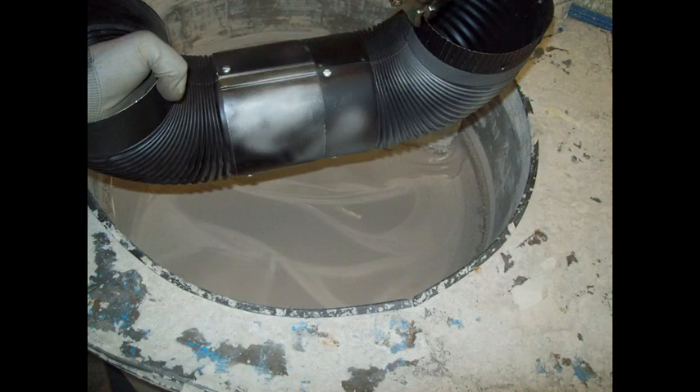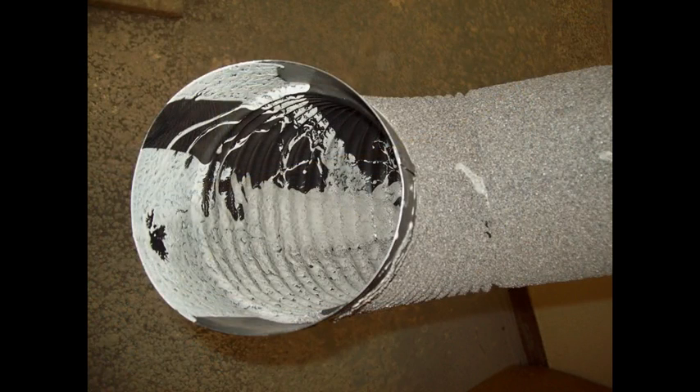This is showing the first part of being dipped into slurry — a ceramic slurry. I have several dipping processes into the slurry. This shows how some of the ceramic slurry got on the inside, which is due to the cracks between the pipes. It also had the first coat of sand put on it after the first slurry dip, and it will go through a couple more dip processes. Another view shows the slurry dipping with the sand dipping on top of it.